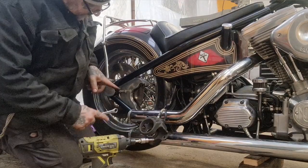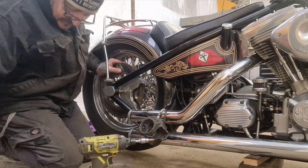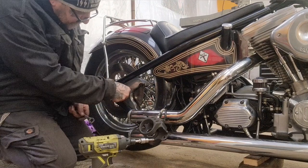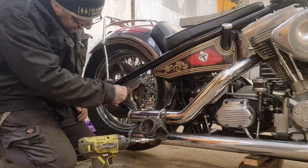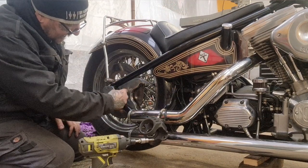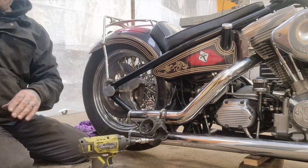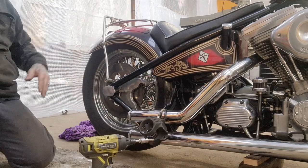When I put it back together I'll just do it until the lock nut touches and then we know we're back where we started. So we'll do that both sides just to give me a bit of slack on the belt side. The spindle comes out. And there's also a little cover on here held in with a tiny little grub screw that I've not got an allen key for - so I'll get an allen key for that, have that cover off, do the same to the other side with the adjuster and the cover, and it's a spindle-out job.